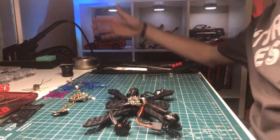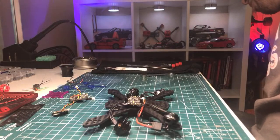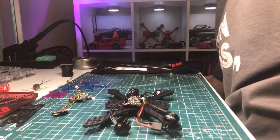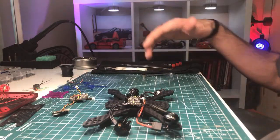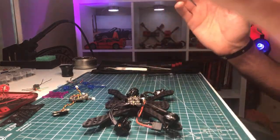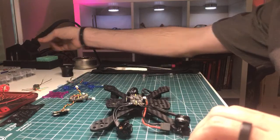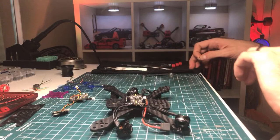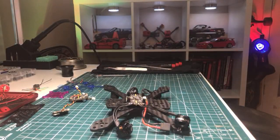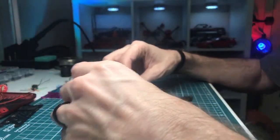I don't know what soldering iron this is. It's one that my dad got me way back when. It's not special. It was less than $100. If you spend more than $60 on a soldering iron, you're gonna get something that can hold enough heat and is going to be fine. Just get the blue and yellow Hakko that everybody gets. That's this one. Or the TS-100. I really wish that I'd gotten the TS-100, because that thing is good enough to be a bench iron and then you can throw it in your bag and bring it with you. But if you're going to get a bench iron, just make sure you spend more than $60 and you'll be totally fine. It'll get hot enough and hold enough heat. My recommendation is going to be the Hakko that everybody has. Joshua Bardwell has a shopping list on his website where that thing is mentioned, or just go to Amazon and type in Hakko soldering iron and there'll be one that has a zillion reviews. So just go with that one.